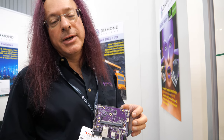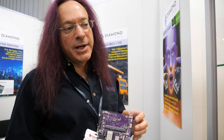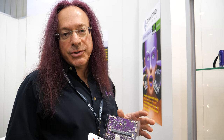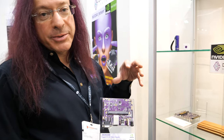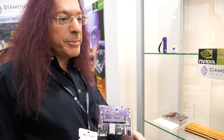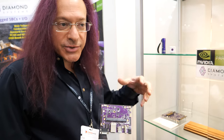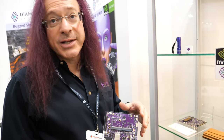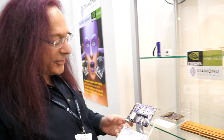Yeah, the most common thing, I think, is really the video analytics. So take a picture and analyze what's in that frame. Do you recognize the person? Can you read the text? Can you detect the motion of the person and what they're trying to do? Things like that. We have one application, for example, where they use the Jetson to analyze the video frame to watch people going into a building. So they can tell if it's one person or two people, or if you're trying to pull equipment in that's unauthorized, this kind of thing. So they use the AI in real time to detect whether the action at the door is authorized. And that's an interesting application, entrance control. So nice. Very, very interesting.